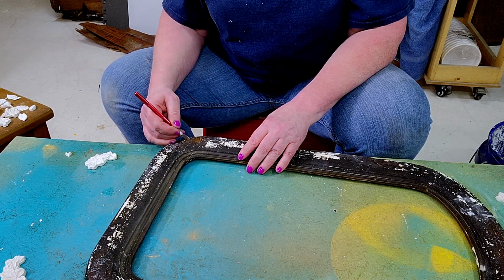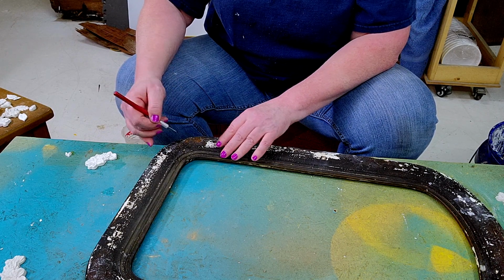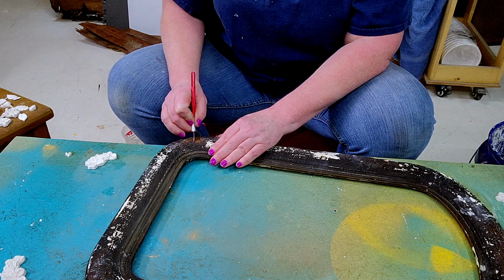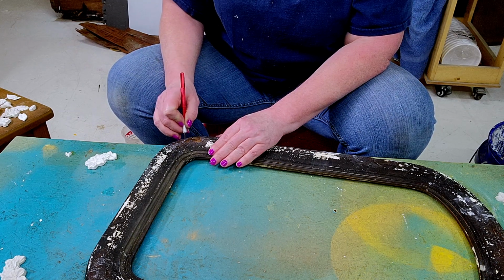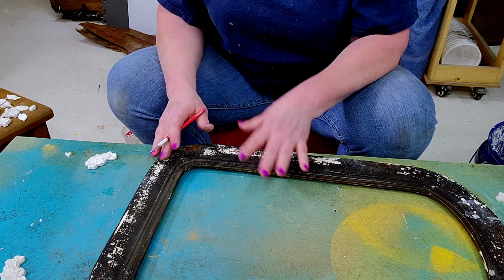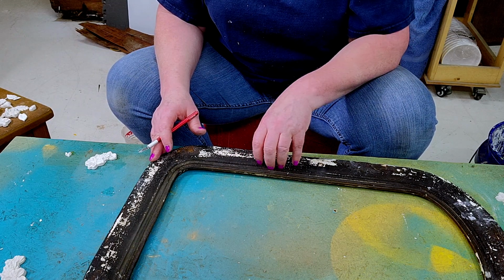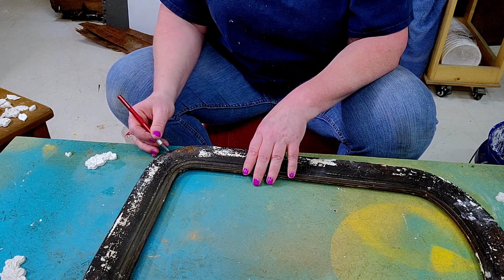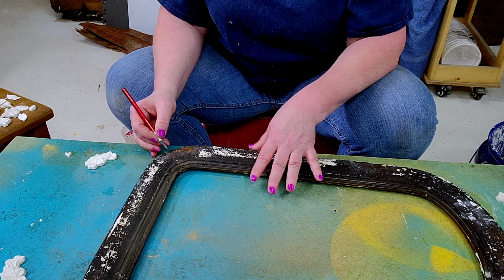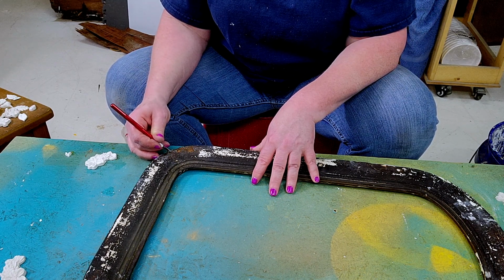All of this paint was lead tested. Be sure that you lead test, and we'll put a link for the lead test strips that I use down at the bottom, but you should always lead test everything just to be sure that you're not exposing yourself to anything dangerous. And should you find lead, it's not a big deal. You can always strip anything that has lead paint with a chemical stripper. Wear a mask, wear gloves, do it outdoors if you can, or in a very well ventilated area, and only sand after all the paint is removed. You do not want to create dust.